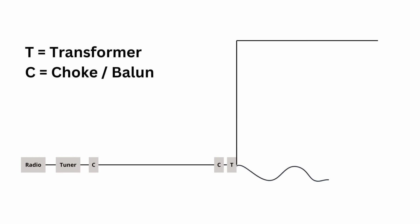So this is a rather simple diagram that depicts an end-fed half wave in what's called an inverted L configuration. So that means it runs vertically up and then over to one side or the other. Typically, you would want to have around 2/3 of your antenna running up vertically. The squiggly line at the bottom represents our counterpoise, and I didn't hear John mention anything about a counterpoise. So we want to use a counterpoise on our antennas to give our antennas something to work against.